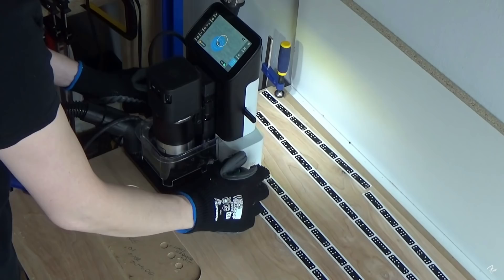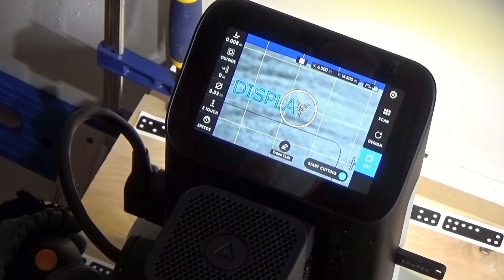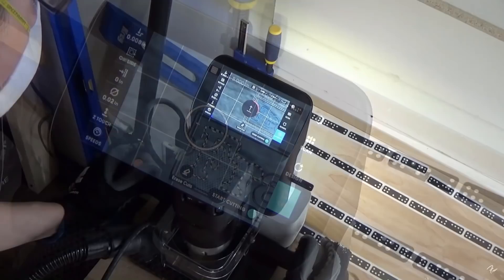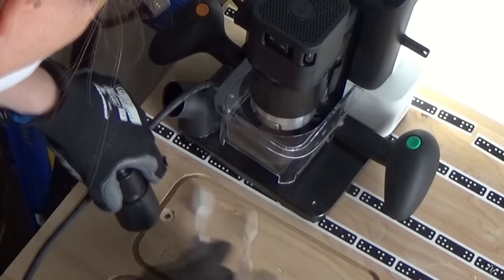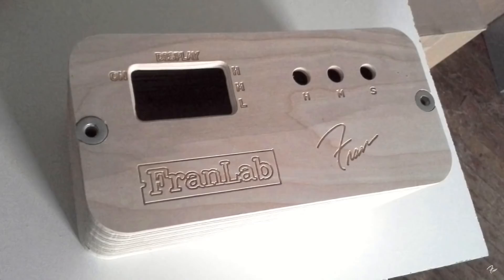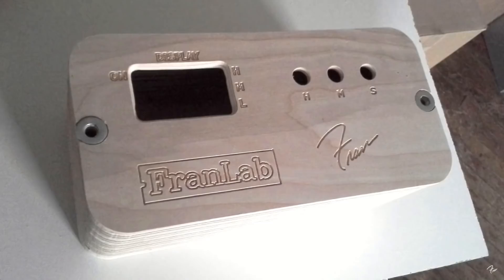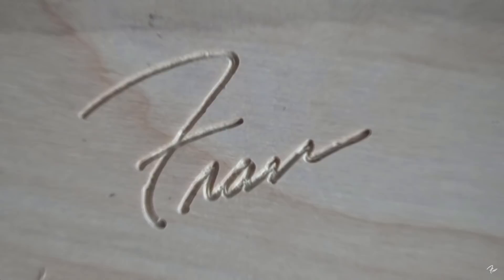First thing I've got to do is mill out a recess for a pair of washers that are going to be used to hold the bolts. You can see it milled out a perfect fit, nice and flush. When I'm using the auto-routing function, the detail is actually quite high and the plunge and also the speed of the actual routing itself — no worries about having complete control. I found that a toothbrush is a handy tool when you're doing engraving or small cuts — just run the toothbrush in there, it gets all the little gravelly bits out of the engraving. The final part was milling out my signature. Well, that's it for this one. I'll post some updates on this clock project as I get it together and finish up the case. I'm Fran, I'll see you soon. Fran Lab. Quickie!